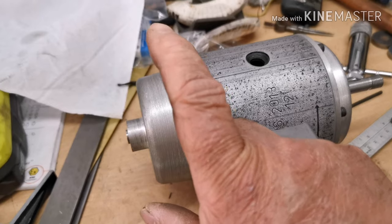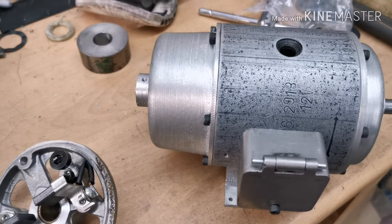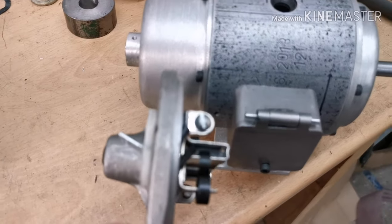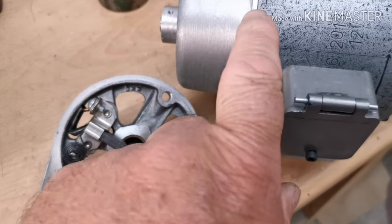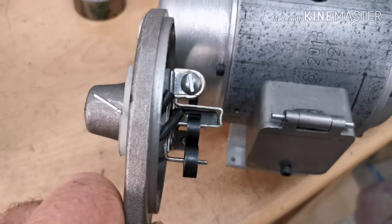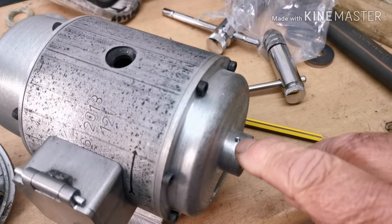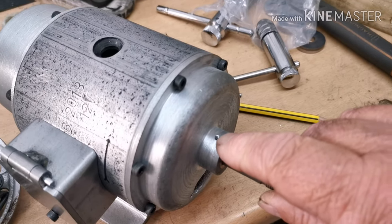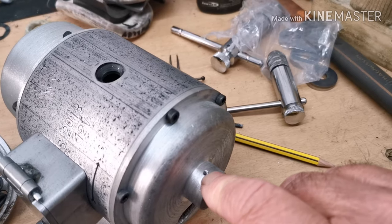Now we've got to sort the brushes out in this end and then rewire it so it's going into the box. I'll have a think about for the next video whether to remachine this end and leave the brushes on the plate and fix that in, or make a new plate and remount it all together. I've only got about an inch and an eighth to fit the brushes in. Also you'll see I've drilled some holes there for oiling on each end, but I don't like just a countersunk hole — I'm going to make a couple of oilers like I did on the front wheels, screw in with a brass top on it.